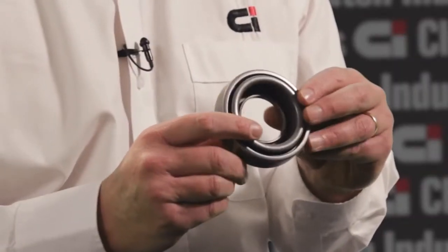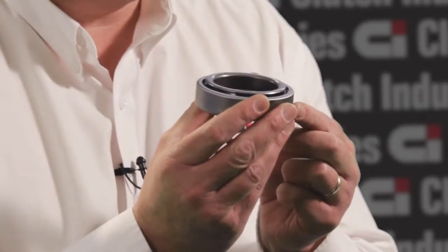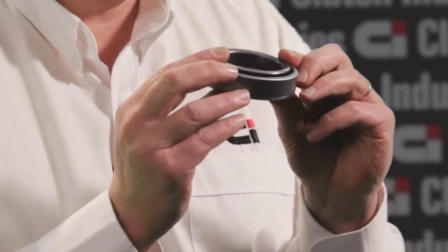In this case it's very straightforward. We provide a self-aligning bearing in this application. A self-aligning bearing is where the actual bearing face can move independently of the rest of the bearing, and this allows the bearing face to locate itself in the optimum position in the application.